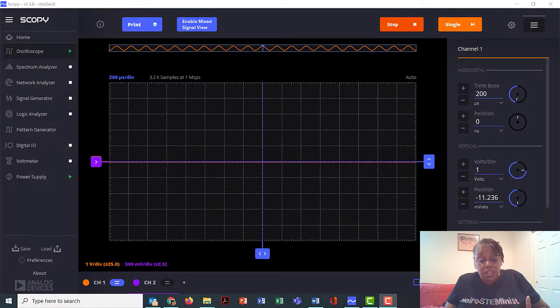All right, here's my first fail. I thought I was super duper careful in wiring this puppy up, but close but no cigar, I got nothing. I've turned this pot totally clockwise. I've turned this pot totally counterclockwise, and I'm getting no signal. So I now need to step back and check the wiring for this whole thing and see if I can figure out why my oscillator's not going. The oscilloscope is on.